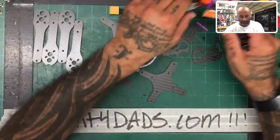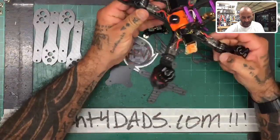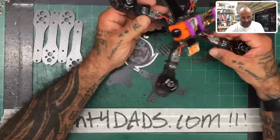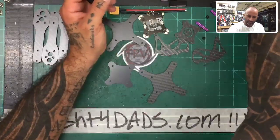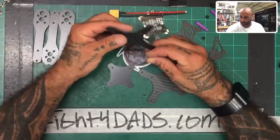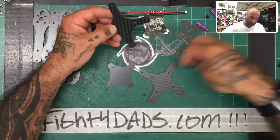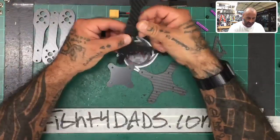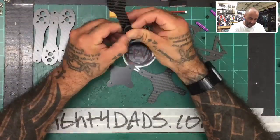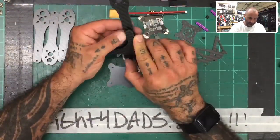But what I did here is I'm just gonna look off of mine. So we are going to use, let's see, that's 5, 6, 7, 8, 9. Let's use a 12. The red screws are 12 millimeters, so I'm gonna go ahead and use a 12 millimeter screw. All right, and I am going to do it just like this. So let's knock it out. 12 millimeter, 12 millimeter, and then we'll put the bottom plate.